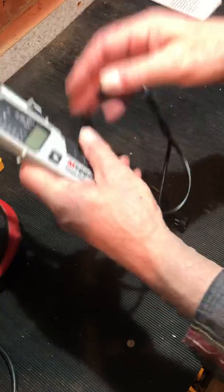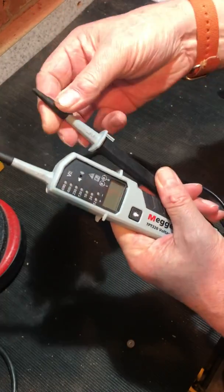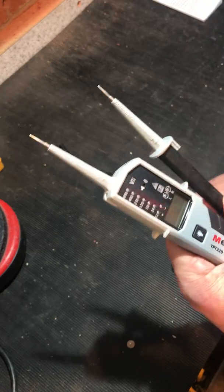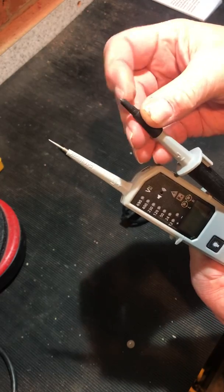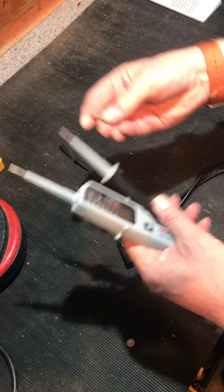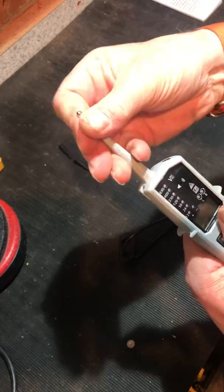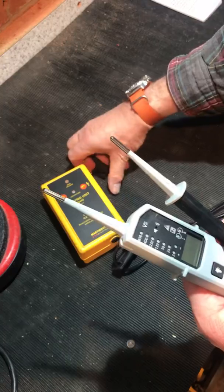Probe tips are GS38 caps as with a lot of the others — 12 to 15mm of pointy steel, which you're probably going to need. I don't know whether you'd get that in a ceiling rose. For some reason these are sold with euro tips which now don't give you a small shiny point — they give you a big fat shiny end.